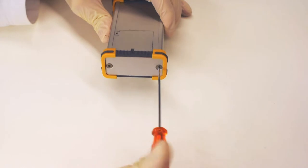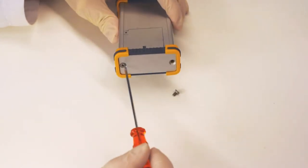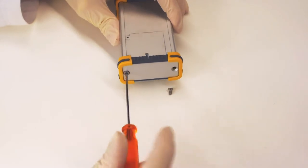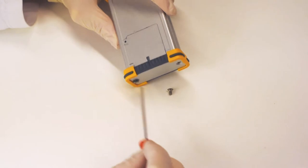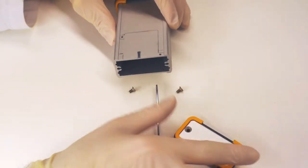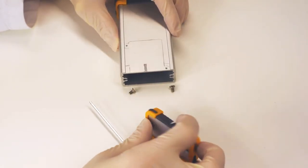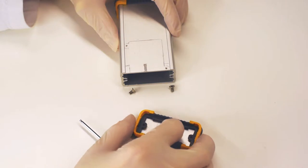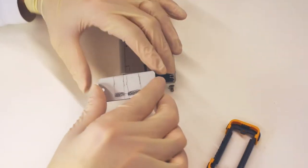There's more holes which we need on the front plate, for instance to access the USB connector of the pyboard and the SD card slot, and these are best marked on the inside, simply because it's easier to just hold the pyboard in place and then hold the front plate in front of it. Here's the other hole to hold the pyboard in place, and here are the markings which we need for the rest of the access to the device.